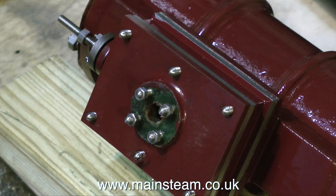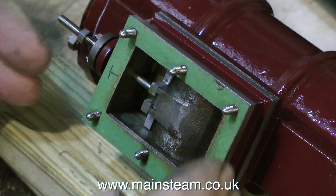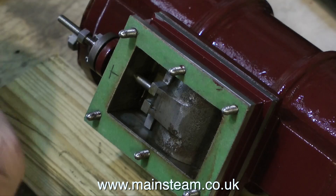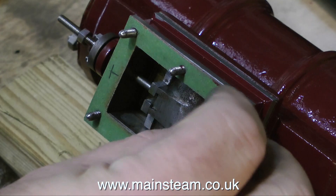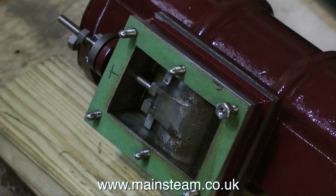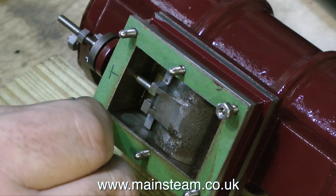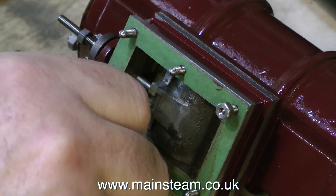This clip shows the steam chest cover in place. This was a temporary fitting — I almost immediately removed it and just used a couple of nuts, one in each corner, to hold the steam chest cover in place, because I'll need to see the valve as I adjust it when I finally time the engine. I'm not over-tightening these nuts because I don't want to chew up the gasket — no spanners needed. As I said, I'm taking no chances on the reassembly of this engine.